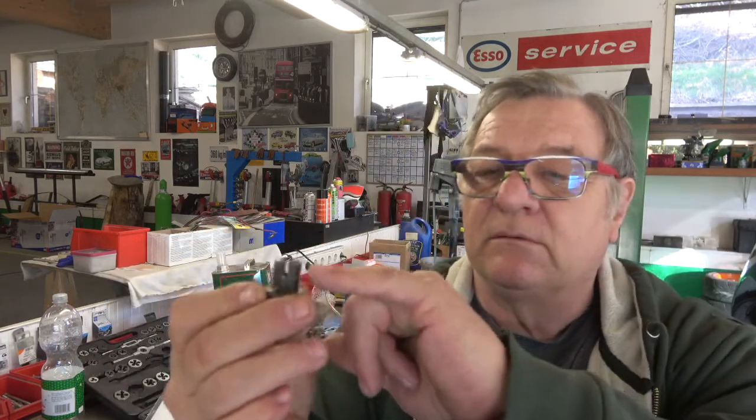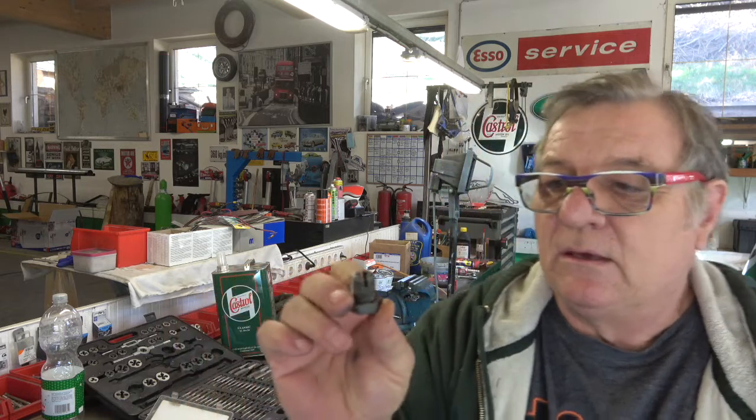And you can see this is the original plug out of it, and you can see the way it's been cut, obviously to not sit against the aluminium so you don't strip it. That's obviously an issue. So unfortunately they were stripped. There's just no way, so Amir's built a brand new nut for it. Fortunately we had an M18, it's metric, but that was the biggest plug we had. So he's re-tapped it, and we've made a new one, and that's in now.